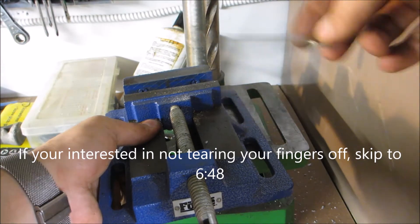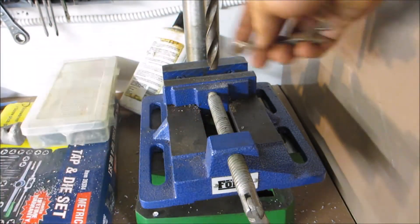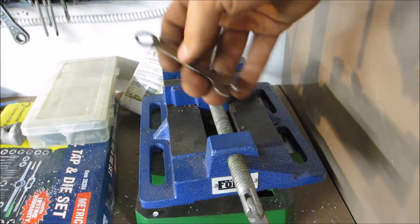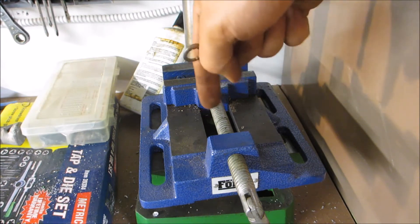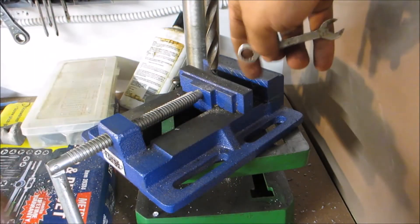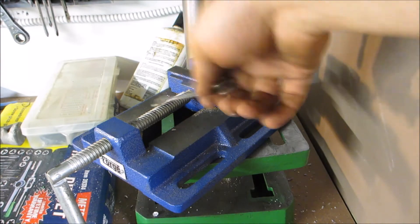One of the things that a lot of people are very much tempted to do on something like this — where it nearly fits — is grab the next size hole up and guide it until the bit catches and it either breaks a finger, tears off a finger, or at least cuts you. Be smart. I don't want to be a shop nanny, but be smart. These drill press vices cost next to nothing — get one. Use it to fasten your work down and drill the holes. It'll save your fingers.